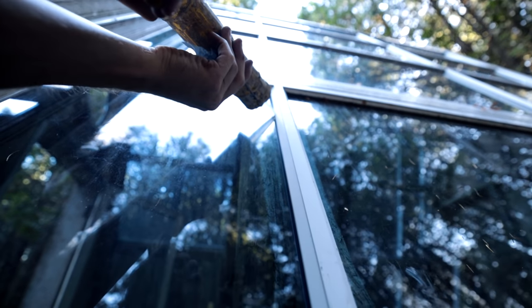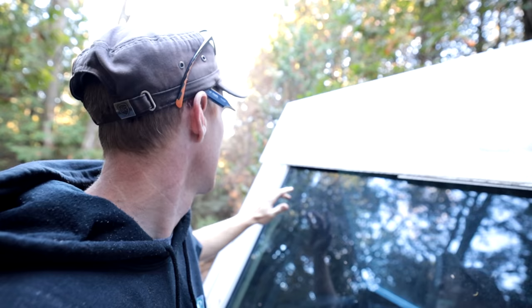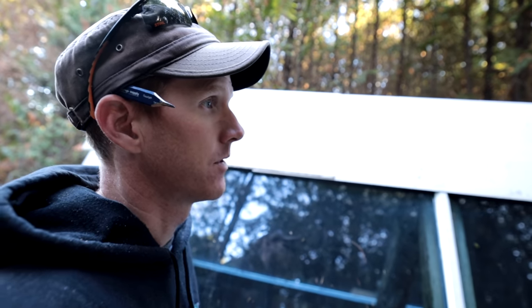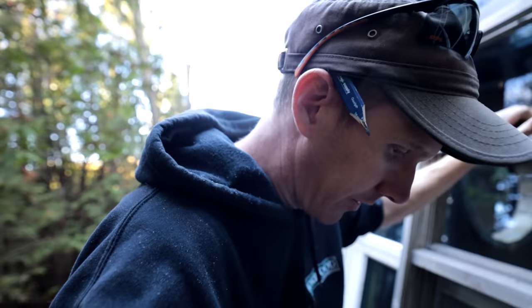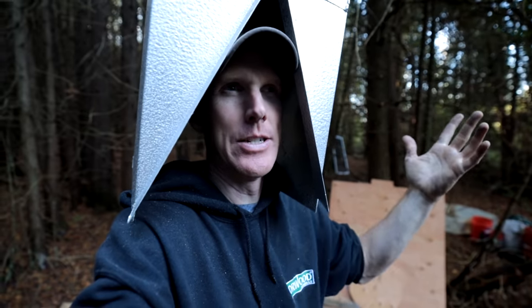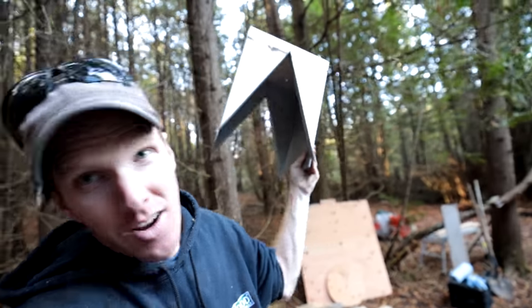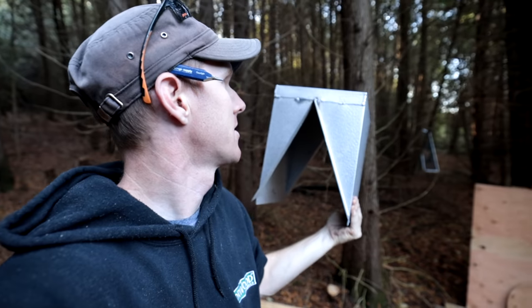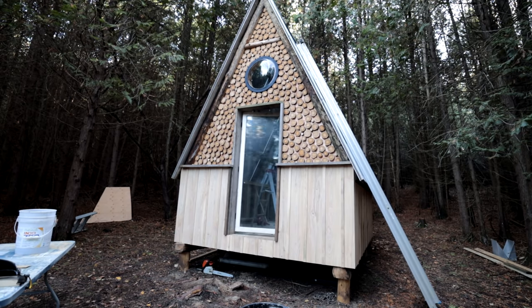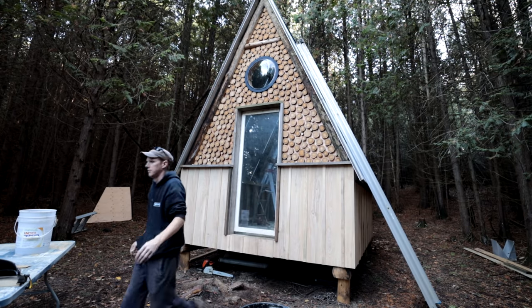Here's the ridge cap — bent aluminum from the old garage door panels. It was quite precarious to install so I didn't film much of it, but it's on now and it didn't cost me a dime. She's got her hat on nice. I also have the chimney cap here — custom bent to the proper size for the ridge cap. It's got a nice slope on top to shed water and it'll allow the chimney to go through it. Looks like something you'd wear to battle in the Middle Ages, but it works.